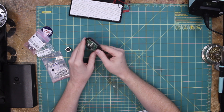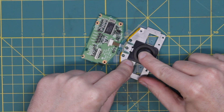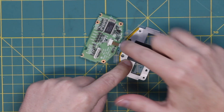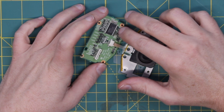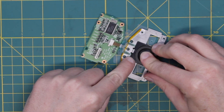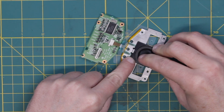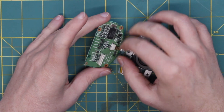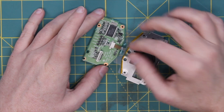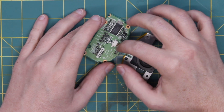I want to replicate this as closely as possible. This has come apart — this is the actual works inside. This is your little mouse nub trackpoint stick pointer thing. It communicates to this little microcontroller here and translates it all into mouse movement. Essentially what you've got here is a pair of strain gauges — an analog value coming out based on the amount of displacement on the X and Y axes. The problem is this is going to be really hard to interface with, and it's really fragile too.